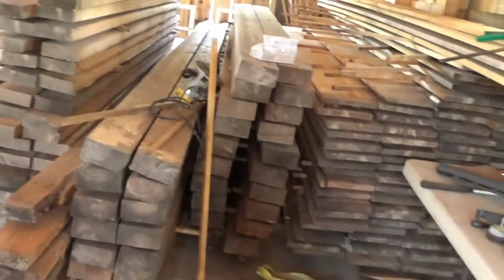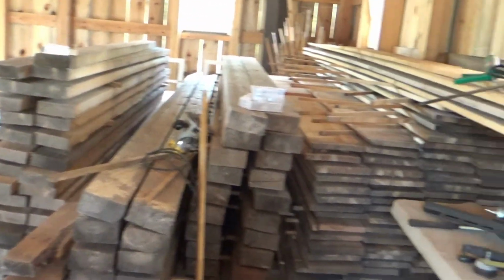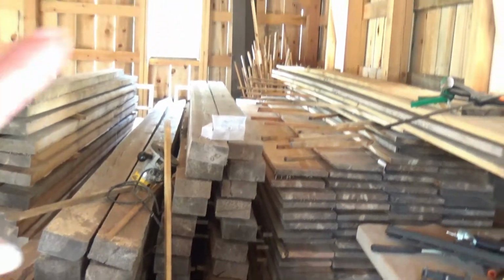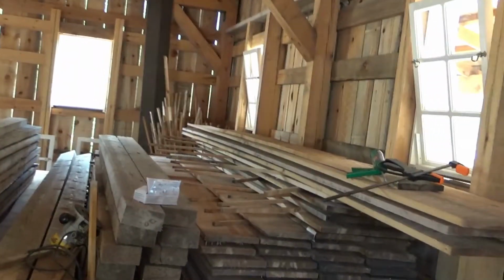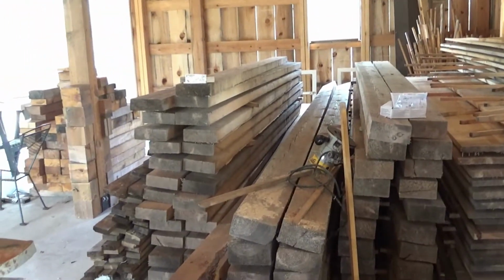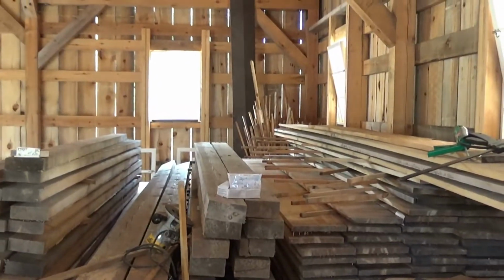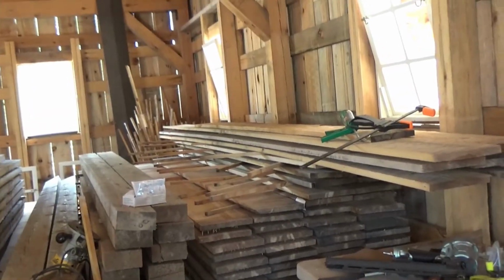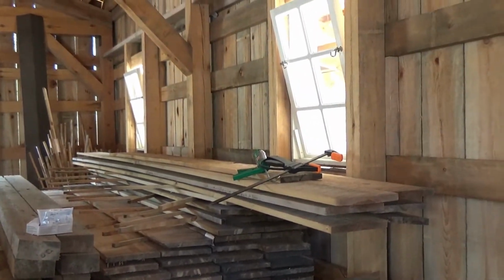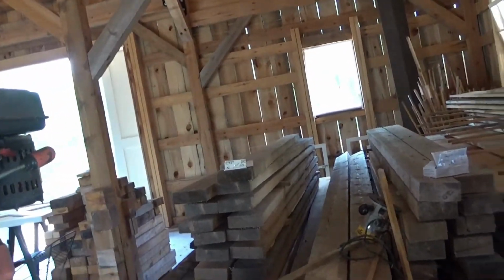And look at all the wood. I thought you had a bunch when you first brought the whole kit in, but that's amazing. I had lumber stacked everywhere. And all the little sticker sticks to keep it straight and keep air between them. Now, did those come, or did you have to actually make those? It all came like that. Oh, wonderful. Every stack of lumber had those 1-inch spacers between it, and it kept the boards flatter, allowed them to air dry.